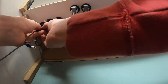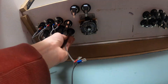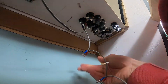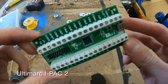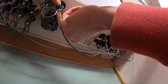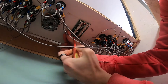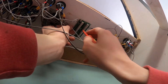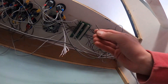Just in case that made no sense, I'm connecting daisy chains to all of the LEDs — there's a red daisy chain for positive and a blue daisy chain for ground. The other end of these daisy chains is then going to be connected to a USB which can be plugged into the Raspberry Pi for power. I also made a third daisy chain which is yellow and was used to connect all the grounds of the switches together. This is the IPAC2 — it basically takes all our inputs from the different switches and maps them to a USB so that the Raspberry Pi can understand them. The final connection to make for each switch is to the IPAC2: take one wire, connect it to a switch and put it in the corresponding place on the IPAC2, and rinse and repeat for all of the switches. There are eight switches you actually interact with, then coin, start, and the joystick directions — up, down, left and right. The joysticks were a bit of a pain; I had to continuity test those white cables and make sure I connected the right switch into the right terminal.